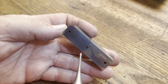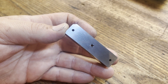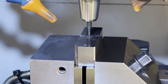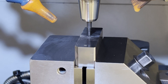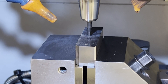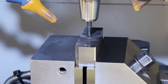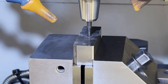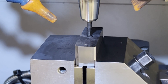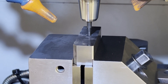Moving on to the milling, I have to be careful with this EDM feature — if I go ripping across it, it can chip. So what I'm going to do is counterbore that area at reduced feed rates and reduced depth of cut, baby it and get that stock cleared off, and then go in and rough the rest of it. I also have the option of roughing it with a surface grinder with a diamond wheel, which is actually what I would have done on this part. But I wanted to show this because sometimes you get an EDM feature that's not accessible with a grinder.